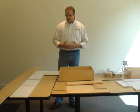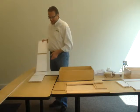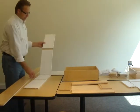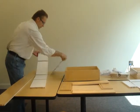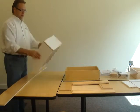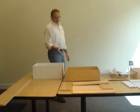The other product that BHK has is a miter fold drawer blank, like you see here. This is a neat product in the fact that you specify your length and your width to BHK. They will take that length and width and they will groove the drawer blank to create the size of drawer that you need, and it will simply fold on the miters. So what you do is you insert your bottom, you fold your drawer together. At the one end there's dowels and holes. Just put it together. You have nice mitered corners and a beautiful looking drawer. The drawer is available in the various vinyls that are available from BHK.